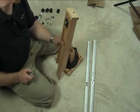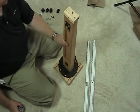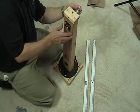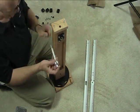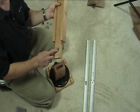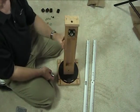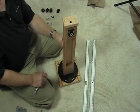Although you can put the unit together in different phases — you can mount the I-beam in the base initially and then go from there, or you could start working with the aluminum arms — in this case I'm going to get the I-beam set up and put the shaft through from the back. The front of the I-beam has an exposed T-nut, and that should be towards the logo plate. This is very important because if you put it in backwards, it can actually work itself out over time. We usually mark the word 'back' right on that section of wood.